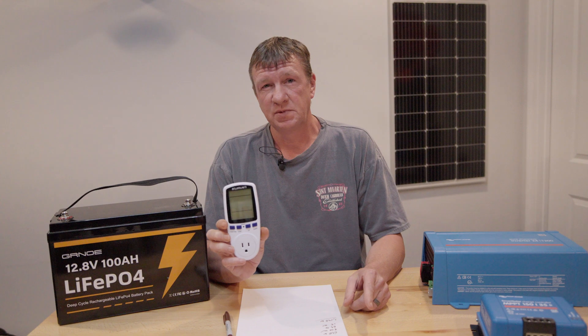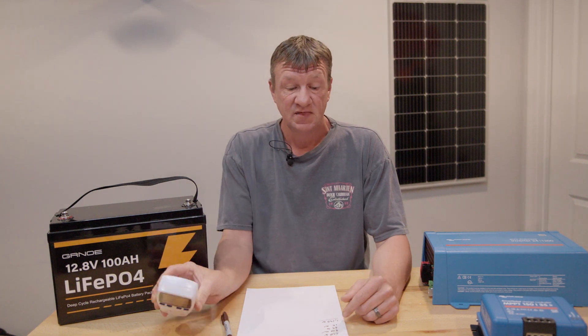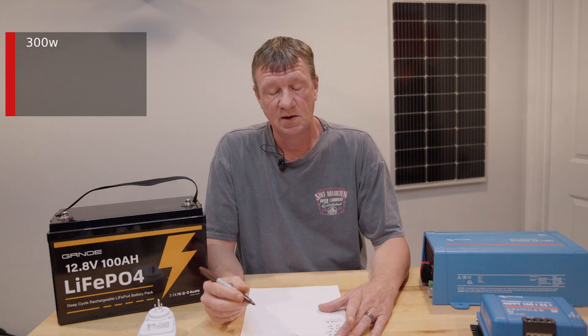They're cheap and you can find them everywhere — I'll put a link in the description. Plug this into the wall; you can hook it up to a power strip and connect all your devices at once, or plug one or two in at a time if you have too many devices to avoid overloading the unit. I ran all my devices on this for 24 hours and found I was averaging about 300 watts per hour. That's a big difference from 1,130 watts, so I'm going to use 300 watts as the basis for my power needs.